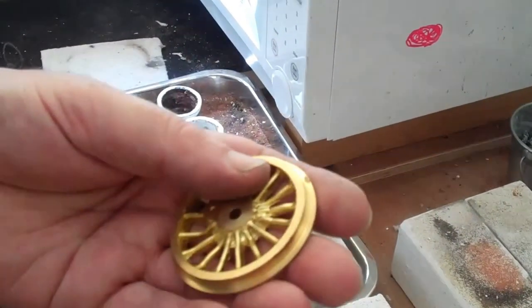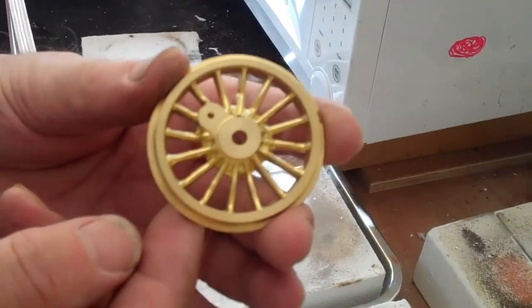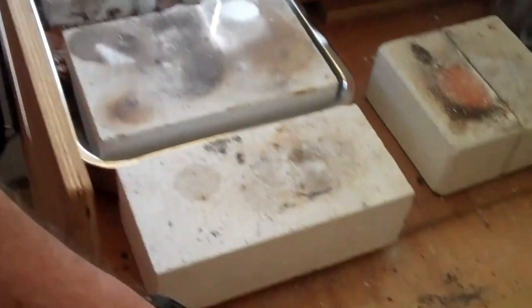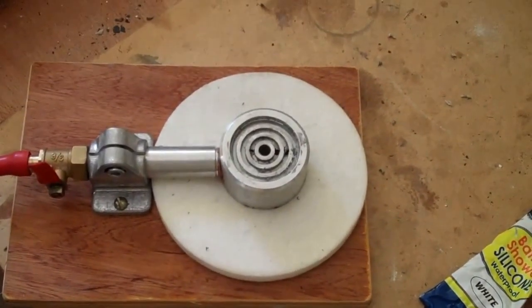The way round is to not individually vent each spoke, but to exhaust all the air from the bottom through a little casting table using vacuum assist.